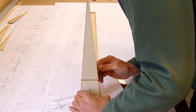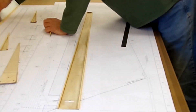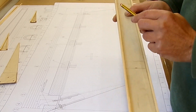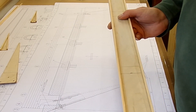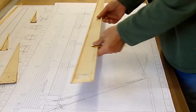Here I am just marking up where the ribs fit on, using the ribs as a marking point and going through measuring and putting in the lines. I've just marked out where the ribs are going to go. I'll put actual indent marks on there so I get those right, and it allows me to varnish inside these areas, especially down here where I won't get very good access. The varnish is kept away from the actual glue lines, so that one's all marked.